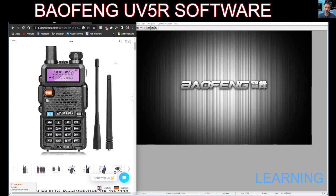Now you may have an older model that can do 220 MHz, but you might have to open it up. The way you do that is you hold down the button beneath the PTT, the PTT, and this orange button while turning the radio on. It will factory reset and that will unlock the TX on 220 MHz if you're in the USA. But check your license to make sure that's okay.